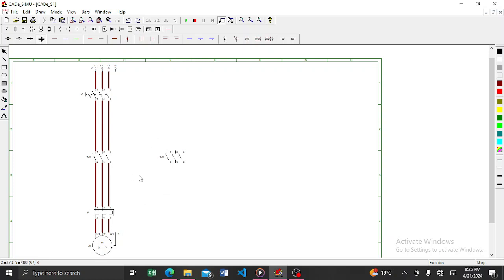In order to connect this reverse contactor with only one phase changed, I'll go with this connection here. Remember, the first one is the red phase — R. I will connect it to the third terminal of the reverse contactor, indicated as terminal five. This swaps the red phase to the position originally occupied by blue.